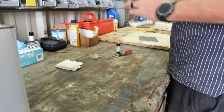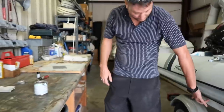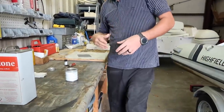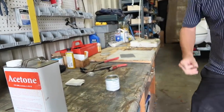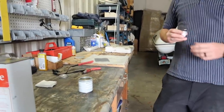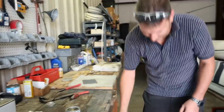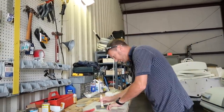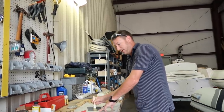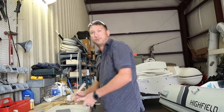This is the two-part stuff — about a quarter of a can left. You want to put one coat on the patch, one coat where it's going on the boat, wait about 10 minutes, put another coat on the patch and another on the boat, wait about 5 minutes, then put them together. Another mistake people make is they take a regular brush and just glob it on. You don't need a lot of glue — cut down the bristles so you can really stretch the glue and pull it. You just want a thin coat.